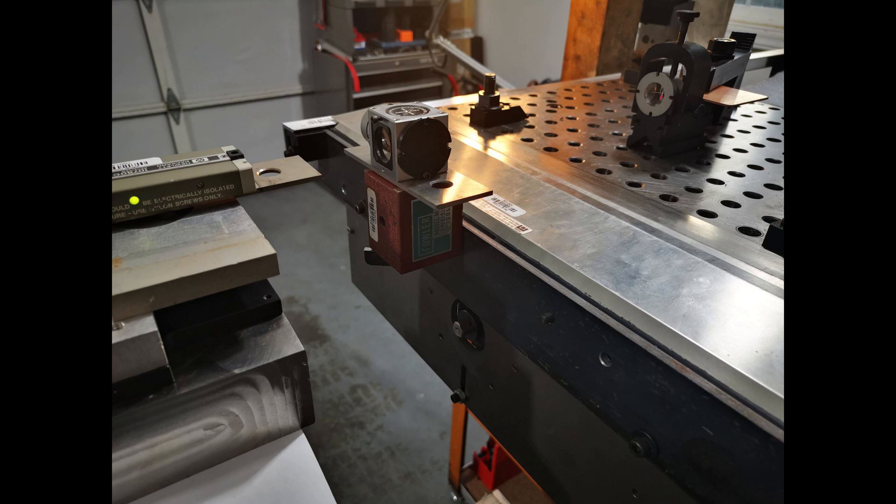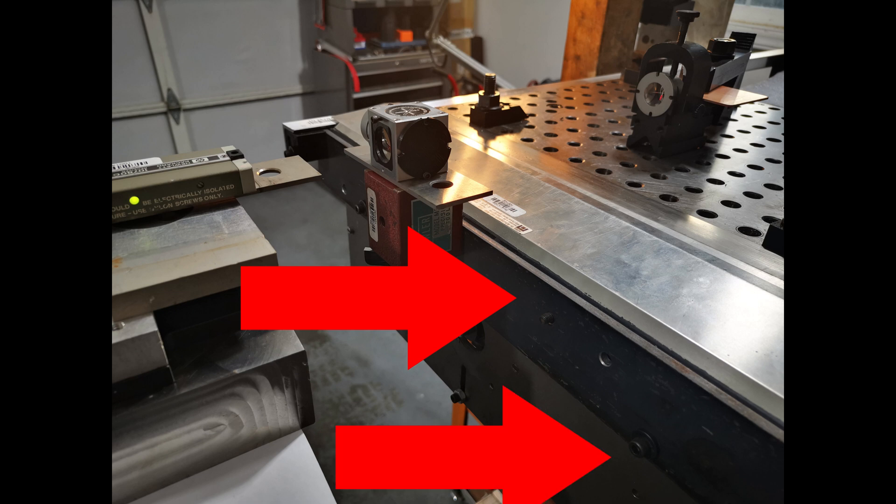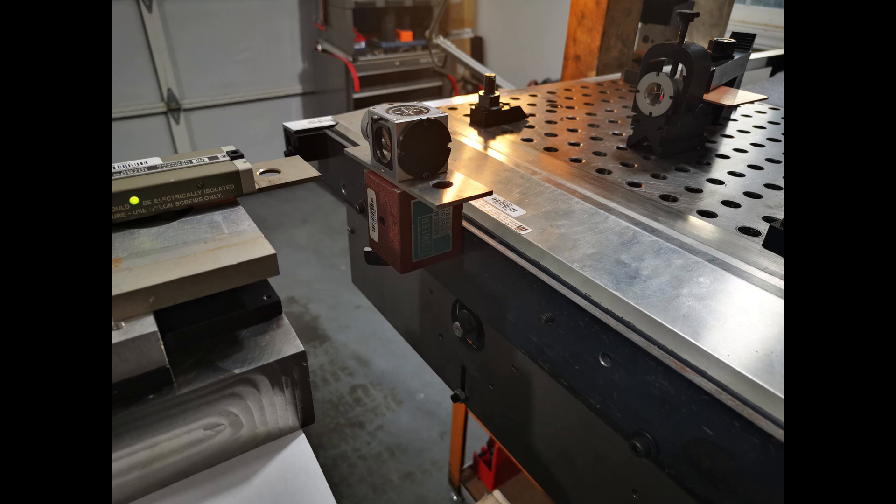There was still the question of how much the vibration measurement was real and how much was just the machine moving and not the table itself. So I went ahead and mounted the interferometer directly to the machine on one of the mounting brackets. It turned out that this exacerbated the vibration numbers. Clearly the steel crossmember to which I mounted the interferometer vibrates more in relation to the moving table than the machine as a whole. In retrospect that makes a lot of sense since that member is only screwed to another steel brace which itself is only screwed into the motor mounts — on the scale of microns it is easy to flex. The machine as a whole is far heavier than the moving table and will only move a small fraction of what the table itself will move for any particular vibration.